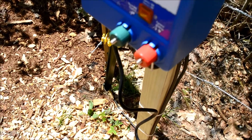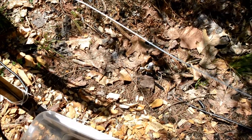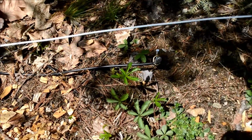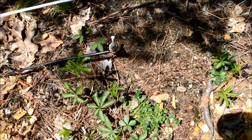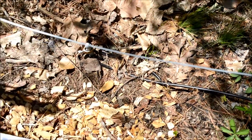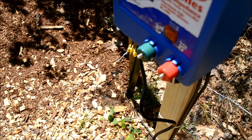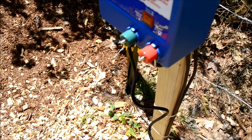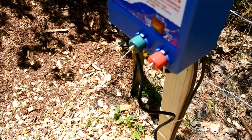The green lug that you see is tied to ground, and that ground wire comes via an insulated 20kV wire down into the ground. There are some rods that have been pounded into the ground — I've actually pounded two grounding rods in and connected them with connectors. So basically I've got a ground wire connected into the ground across two grounding posts, and that wire feeds up and attaches to the green lug on the charger itself. You need a really good ground system to ensure you get a nice high voltage across the wire when an animal touches it and thus produce the shock.